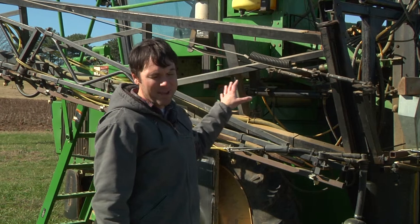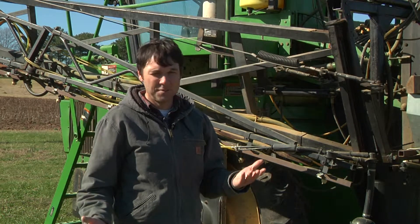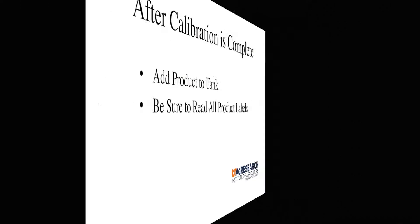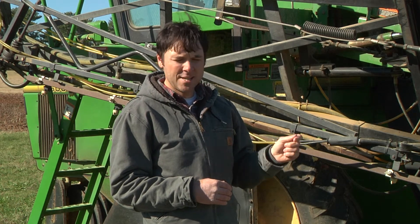If you take your tank capacity — such as 200 gallons — and divide it by your spray volume of 50 gallons per acre, the result is four: you can treat four acres per tank. After you know how many acres you can treat with a tank full, put your product in the tank. Check your product label to see if you need to add adjuvants. Sprayer calibration can be a little intimidating and it's easy to put off, but you'll find it doesn't take as much time as you think, and you'll be satisfied with the results.